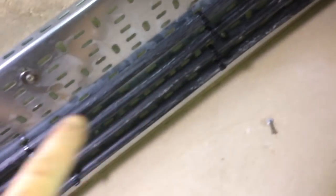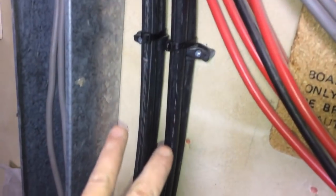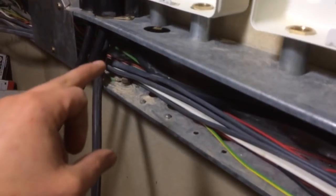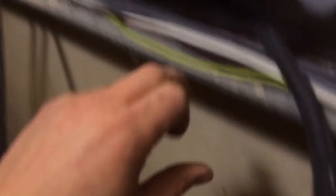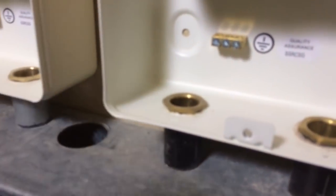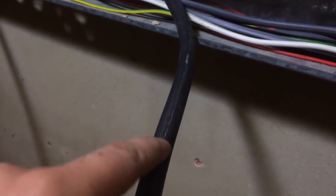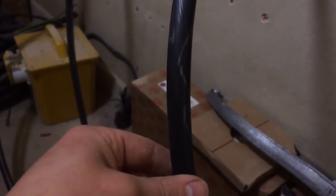Armoured's now installed down here — these are going to get metal ties on because they're overhanging. I've got a nice twist on the cables — saddled and cleated to the wall, comes down into the trunking. Doubled the banjo up there, bolted it into the trunking, and these are now going to come into each switch. I'm going to get that switch bolted in, get these made off, and connect into the load side of the switch. Once you've got your armours to this stage, you can either strip them right back and run singles in the trunking because that's your mechanical protection, or leave the sheathing on right until it comes into the switch and just make it off there.